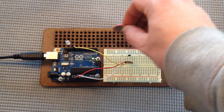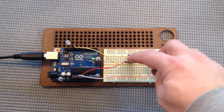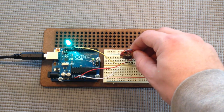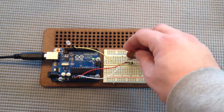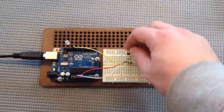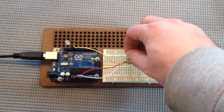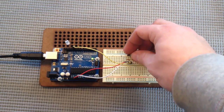Let's test it out with a magnet. This sensor is very focused — the narrower side is the only side that's going to trigger it. I had it on the back and it didn't work, so make sure you have it pointed in the direction you want. This is actually useful because it helps prevent accidental triggering from something that was accidentally magnetized. As for use cases, it's often used as a tachometer to determine how fast something is rotating. You place a Hall Effect sensor and a magnet on the edge of the rotating object, and whenever the magnet swings by the sensor it gets triggered, allowing the microcontroller to track rotation speed and adjust accordingly.